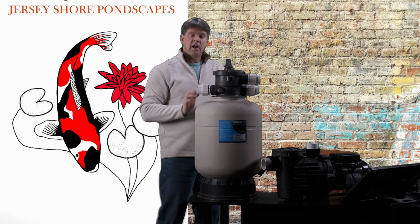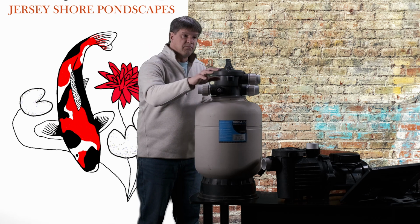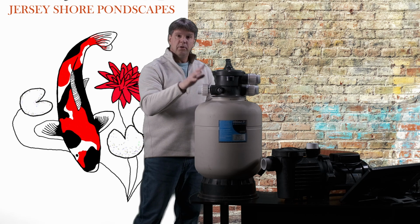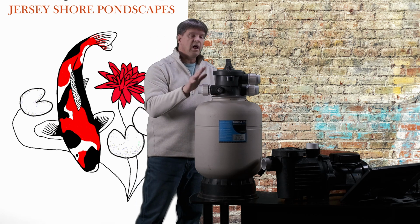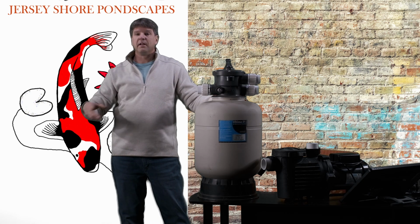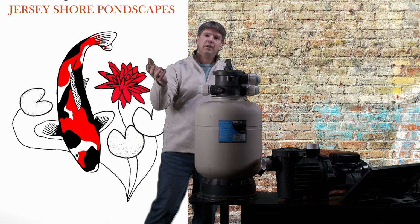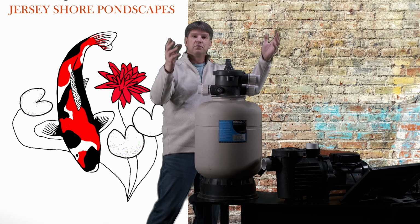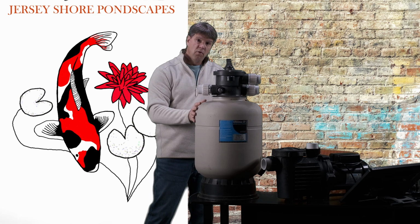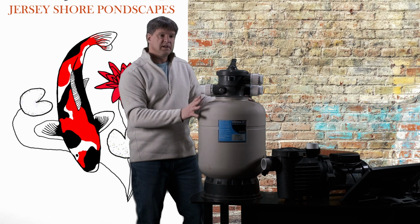If your pond is really dirty, you're going to have to do it more often. If you are setting this up on a pond that's already existing and it's really dirty, right? So you go to the store and they say, you need a new filter, you need to buy one of these. Okay, so you're going to put this on a dirty pond. You're going to have to backwash this maybe every couple days at first, until it starts catching up with the pond and cleans all the pond. Once your pond is clean, then you don't have to do it every 2 days, or every day. You can do it once a week, twice, once every 2 weeks or something, okay? But initially, if the pond is dirty, you're going to have to clean these more. I can't stress that enough, to backwash, backwash, backwash, okay? Make sure these tanks stay clean.